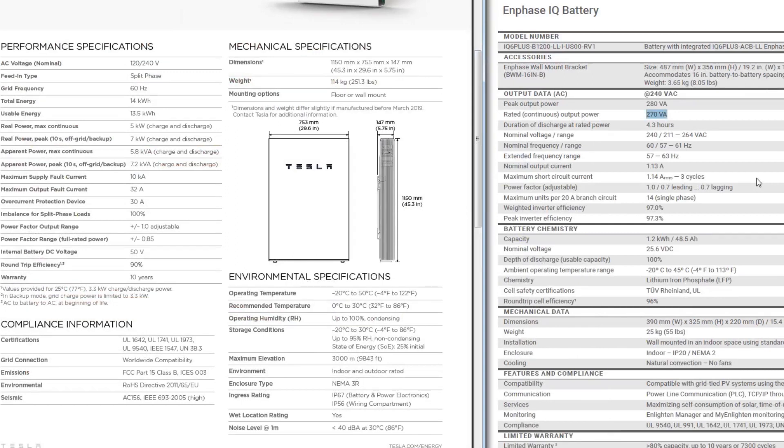Unfortunately, that goes against everything my channel stands for, but since they won't let me do it, I don't have a choice if I want them. I have to have more storage in order to avoid getting demand charges from SRP. I could spend that $18,000 on nine more Enphase batteries, but with a total of 11 batteries I'd only have about 13 kilowatts of storage — and I'd still be spending more than the Powerwalls, coming to about $22,000 total. So it still would not be an advantage, and I'd only be at the capacity of one Powerwall.